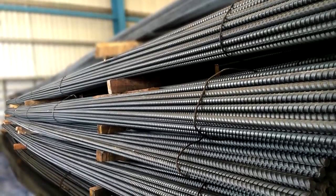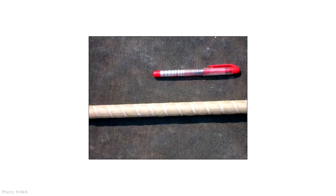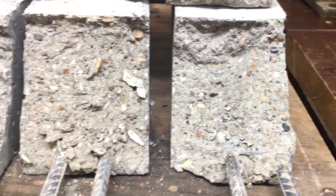You may be wondering: why are we even using steel for reinforcement at all? Steel is relatively inexpensive, well tested, and strong, but lots of other materials have excellent mechanical properties and don't face this issue of corrosion. For corrosive environments, we sometimes use epoxy-coated rebar or even stainless steel. But there are some emerging alternatives, like fiber-reinforced polymers or FRP bars. This is reinforcement made of basalt — remelted volcanic rock forced through tiny nozzles to create fibers that are extremely strong. Options like this often cost more than steel rebar, in some cases a lot more. But the major impediment to these newer, more innovative types of reinforcement isn't just the cost; it's easy to see that those additional costs might be offset by the increased lifespan of the concrete.